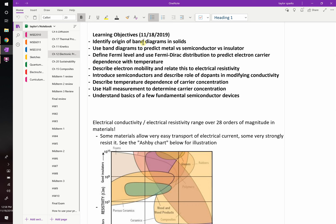The first way is you can generate a temperature gradient across this device if you provide electrical power. I've got a nine-volt battery. I'm going to have Emma hold it — just sandwich that between your fingers like so. I'm going to take the positive end, the smaller end of this, and hook it to the positive cable, and then negative to negative. What do you feel if the battery's not dead?